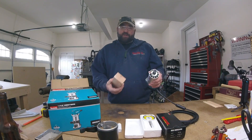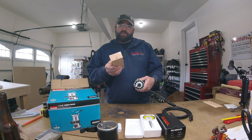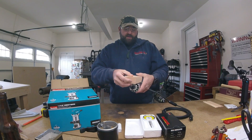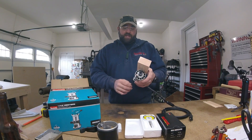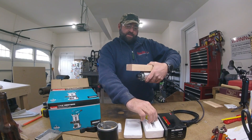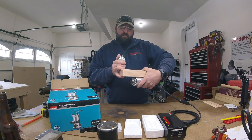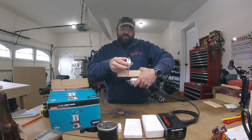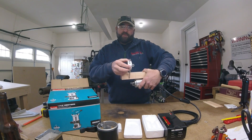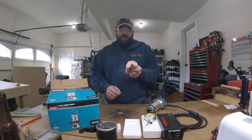How are we going to attach the dial indicator to this? We'll start with a piece of wood. We've got to cut a little bit of a V out of it so it'll actually sit and locate parallel to the shaft or the housing of the router. Once we get that mounted, we can put some sort of a clamp around there to hold it in position, and we've got to find a way to mount this so it can come straight down on the center of that gauge pin and check the runout of the collet and spindle.